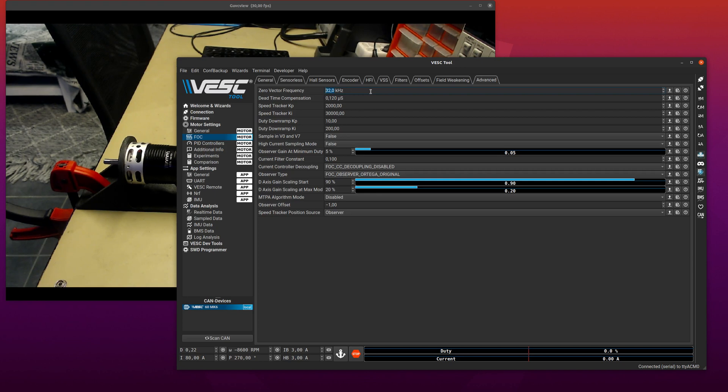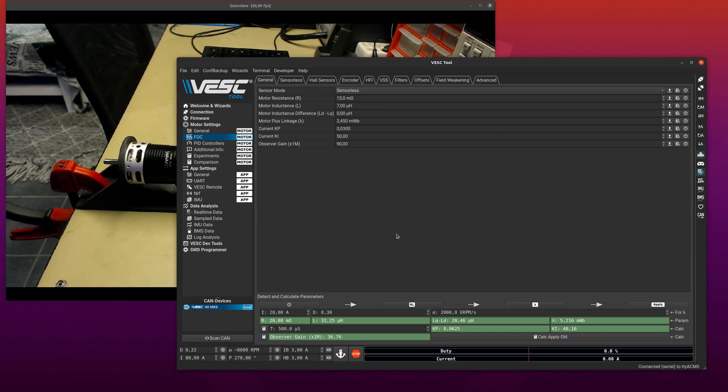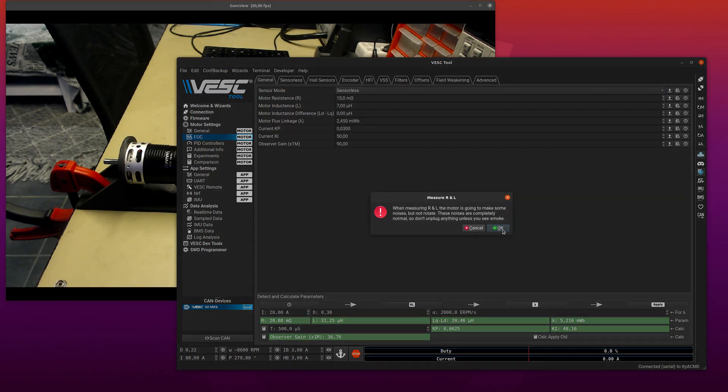I can also point out you don't want to increase this one too much — I think 34 or 35 is the limit currently, because at that point you're not going to make the PWM update in the same interrupt, and then you make the next one, and this will mess with the measurement so then it will not work. So 32 is a quite good number, and then we go to general and make a regular detection.